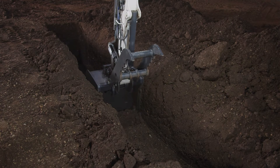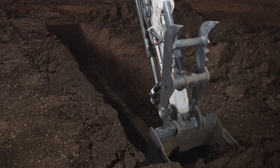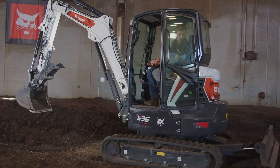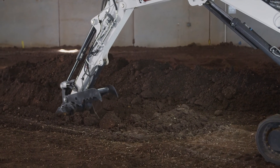The objective is to maintain the solid tone so the bottom of my trench stays on grade. Every time the tracks are moved, the operator must re-bench. In a sustaining a grade application, this is done by benching in the trench at the last known grade point.